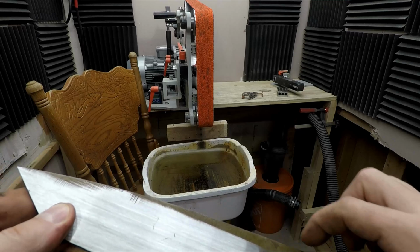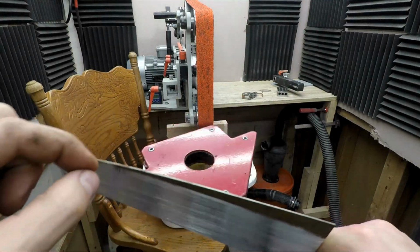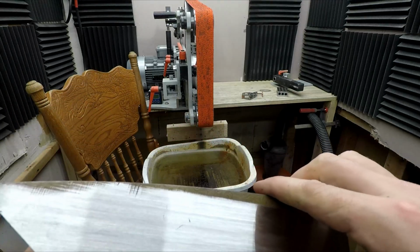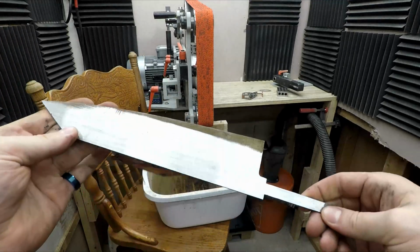But the risk is I'm coming into my rough bevel, so I'm going to lose my centerline reference in terms of my flat spots up close by the spine. I think I'm going to just start grinding that full flat grind, and hopefully these come out. Because if not, unfortunately this blank is going to be toast.